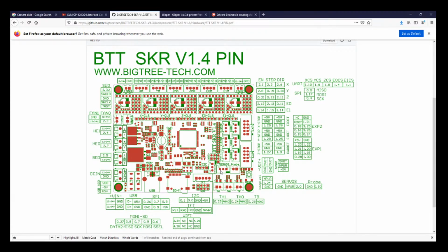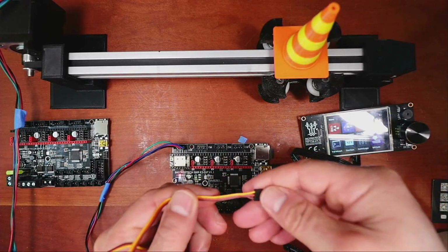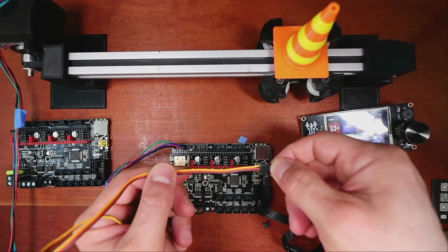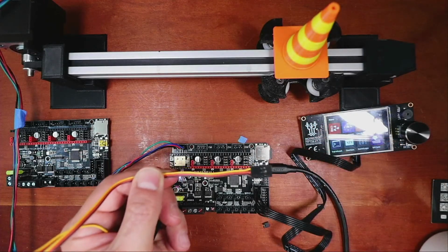So servo, you can see it's ground, power, and then signal. If we look at a servo, let me grab one real quick here. On a servo, you can see the order of it is the yellow in this case is signal, the orange or red, depending upon how you see it, is the voltage, and then the brown is ground. So that's in the right order.